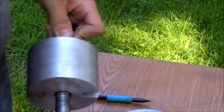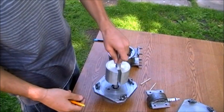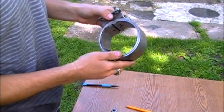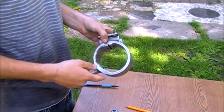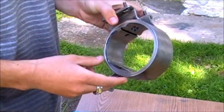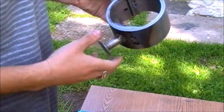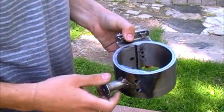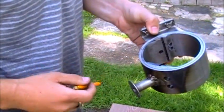This rotor is placed on a cover. This is the stator. The rotor goes inside this stator and it has two hills — one hill for intake and combustion, and one hill for compression and the expansion of the exploded gases.